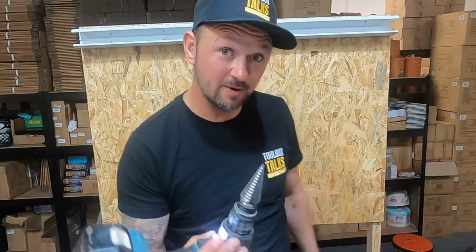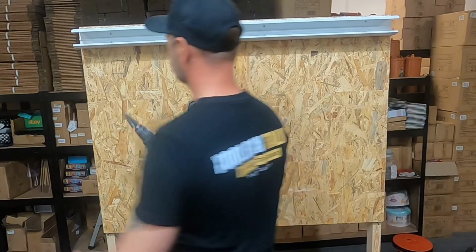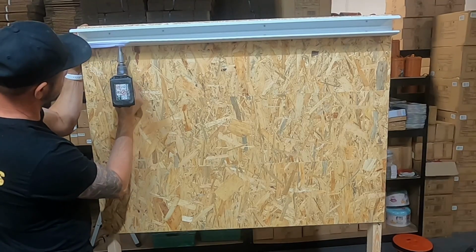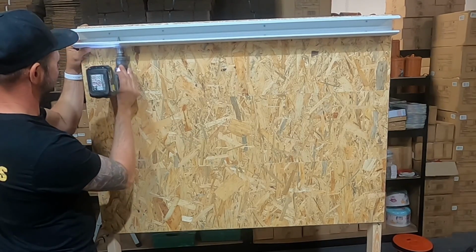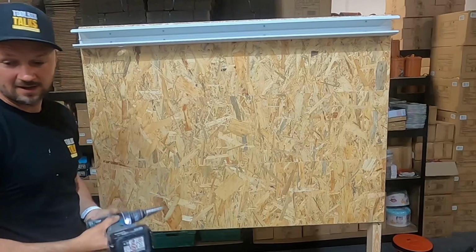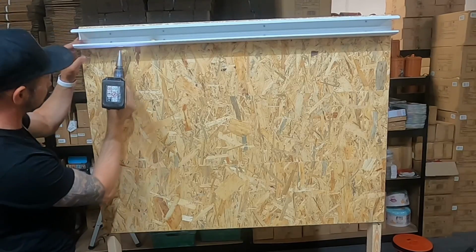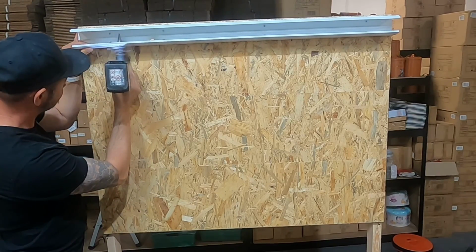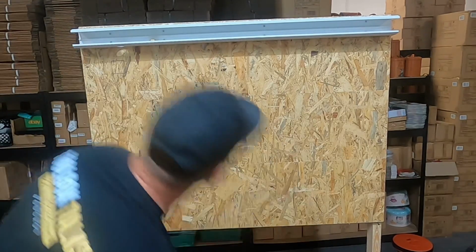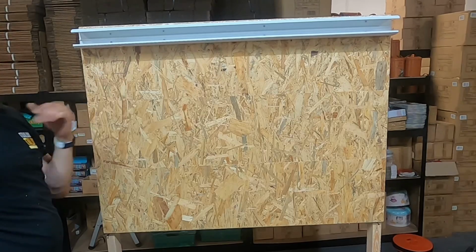And to drill out a 25mm hole in this plastic trunking, I'm just going to use a cone cutter. So, cut up here, go to the centre. And then make sure your 25mm bush. No, a bit further, next step. There we go, get rid of all that. It makes it look tidy. And then drop your 25mm bush through it like that.